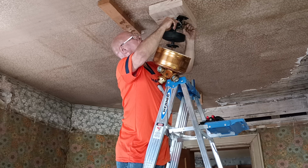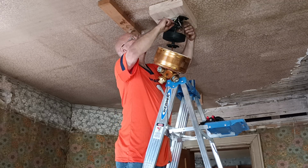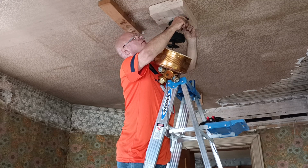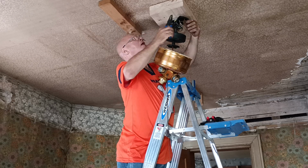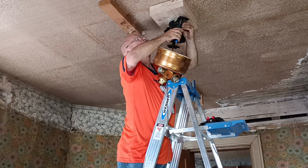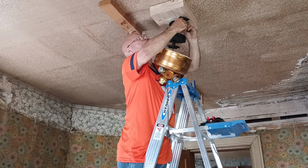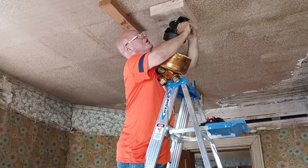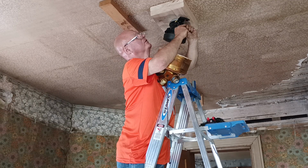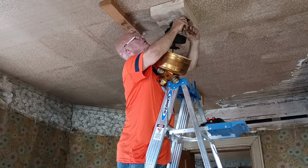So we'll take our white wire, which is the neutral. We'll get our insulation at the bottom, I'll strip it a little longer, and maybe I'll clip it a little shorter. Okay, so I'll get the strands up around the copper there. I'll wrap them around like this, nice and even. Copper even at the end and the insulation even at the top. I'll stick my wire nut on here. Just wrap them both nice and tight.